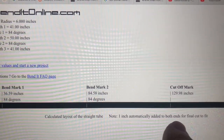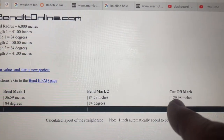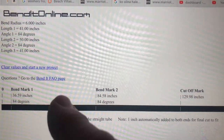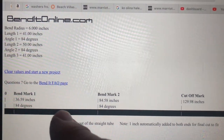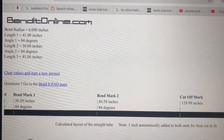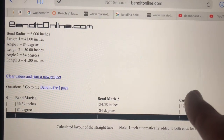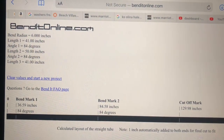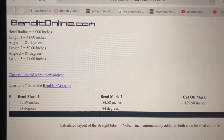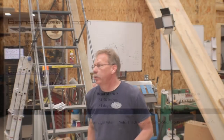The software also notes one inch additional added to both ends for the final cut fit, just to give you room to make adjustments. I mark all the way around using a hose clamp - snug it up to the tubing and use it to trace all the way around, making a really good circumferential mark. I leave the hose clamp on whichever one I'm marking next so that if I spray lubricant or brake cleaner I don't accidentally take my mark off.